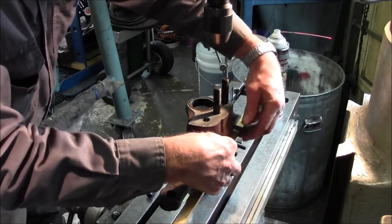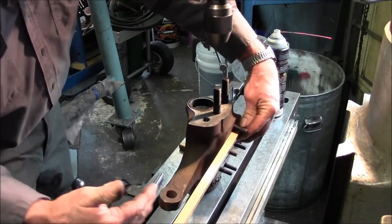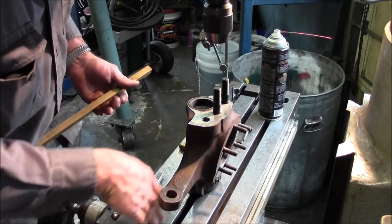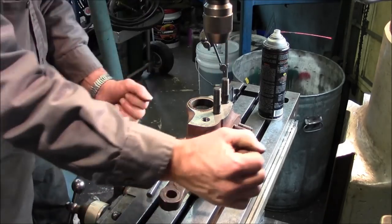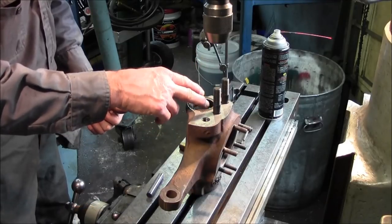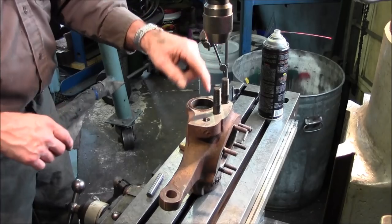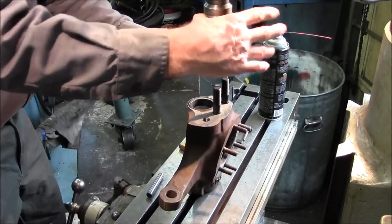All right, now we took our square stock and we put it against that face, and it almost looks like we toe in this way a little bit. And when we stare down on here, it looks somewhat that this arm is straight line in here. But how do we actually figure this twist in relationship to the other part where we have no studs to go on? So I'm going to put my indicator on here, come back to zero, and then come over here with my pointer. Okay, so let's put the pointer in here.